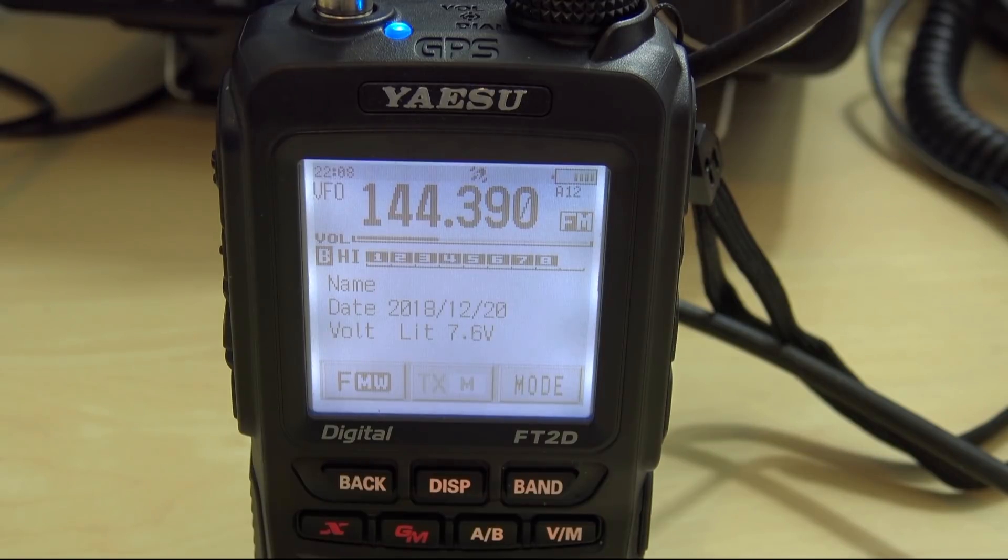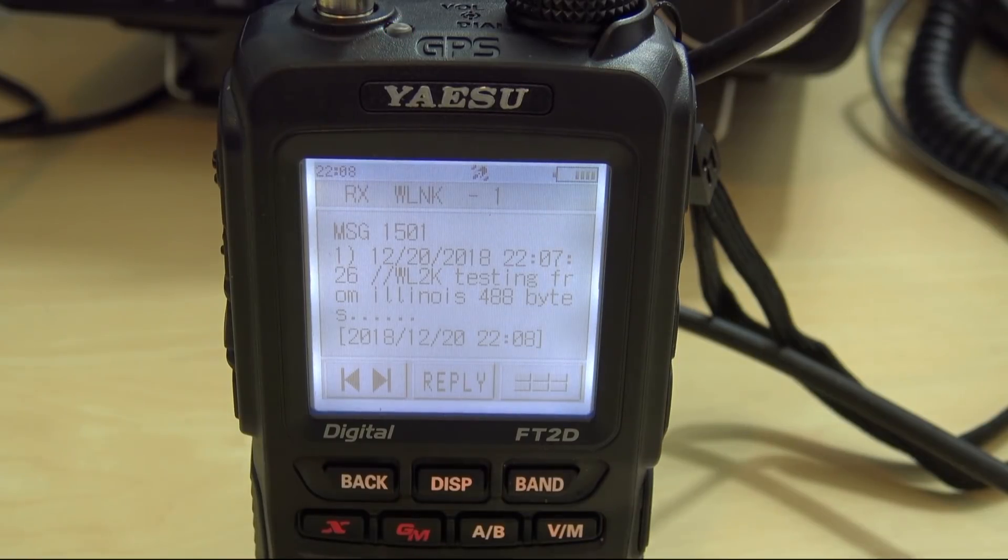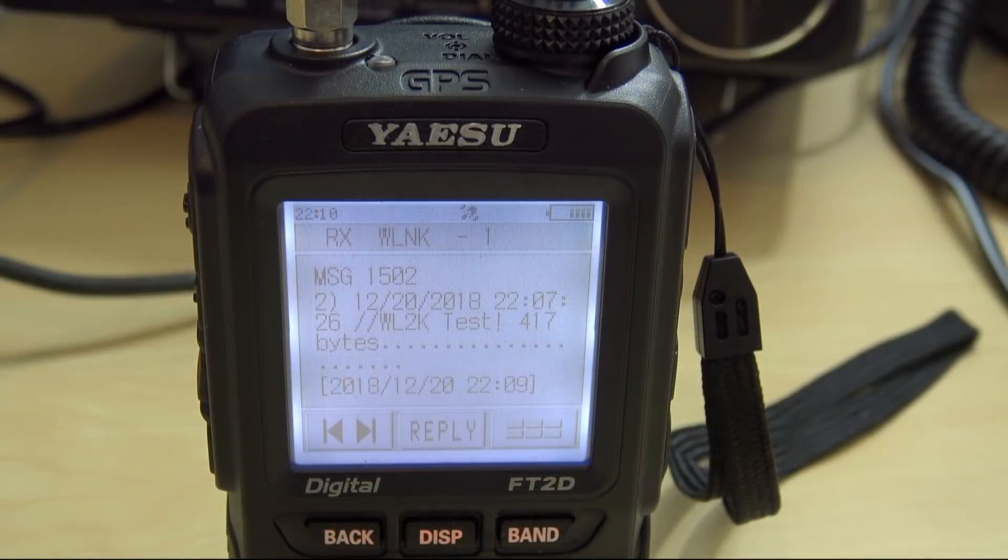There's a message — see it flashing on top. 'Winlink 2000 testing from Illinois.' Somebody sent me a message from Illinois; they must have seen the video and they're testing it. Here's another one — a second message. I have two: number one and number two in parentheses. Another person that must have seen the video — 'Winlink 2000 test.' They might have done that on HF or VHF. If I wanted to reply back to number two, the command is Y — the letter Y — and then the number. So APRS Link does all this behind the scenes. You're just sending Y, number two, space, and then your message. I can reply right from the radio, and Winlink takes care of the rest of it.